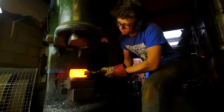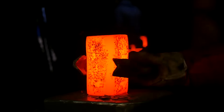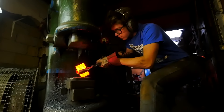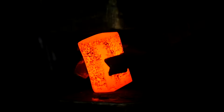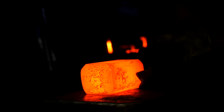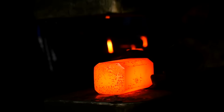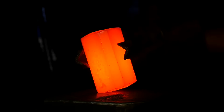Naturally, as we forge this, a slight fish-mouthing or cupping at the ends is going to occur. So, with a quick flattening on the ends, and then chamfering the edges to make it easier to forge the round die and really avoid having to grind too much later, I then round off the ends, fix the rhombus, and then it's simply a case of polishing up the square and making it pretty. And that is the forged square hammer billet on the 120-pound Pilkington.